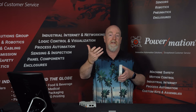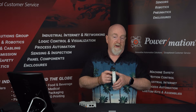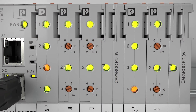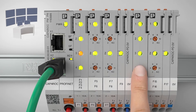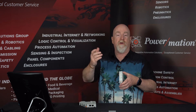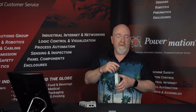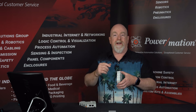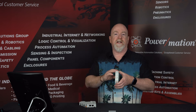Basic operation of the Caprock system is pretty intuitive. There are LED indicators on the front that give you immediate indication of what's going on. Green means everything is okay. Amber means the load on that breaker channel is at 80% or higher of its rated setting, warning you that a trip is approaching. Red indicates an error — wiring fault, short, or overcurrent fault. Flashing green means the breaker is okay but has not been locked down into its pre-configured setting.